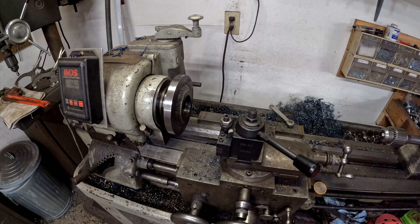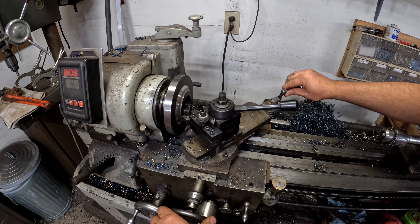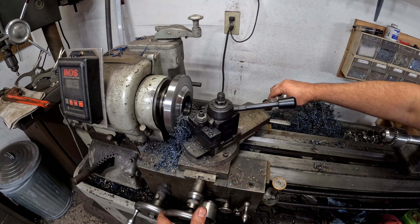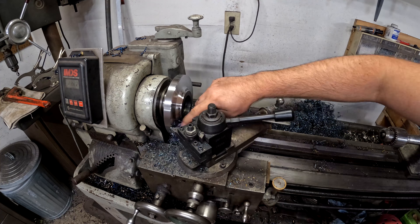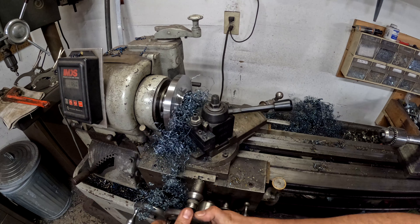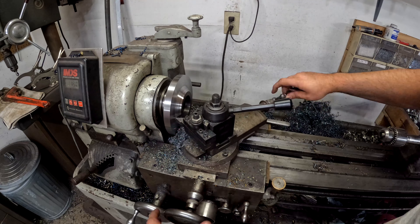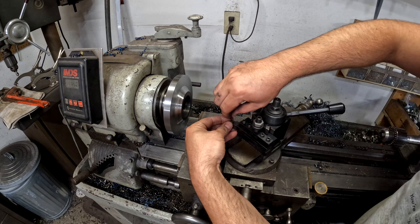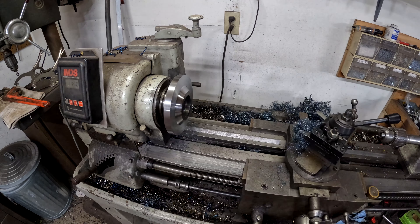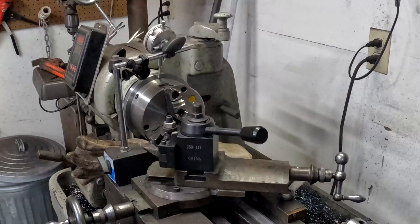It's flipped over and at this point I'm machining off the weld. At the end of the day this is going to look like one piece — you won't even know it was a hub welded onto plate. When I hit that stainless it is hard. It may have work-hardened or there might have been some interaction between the 4140 and the stainless during welding. Machining off that weld was seriously hard and 4140 is just stringy. I've got carbide inserts so I gave it all she had — cheap carbide inserts, destroyed a couple, no big deal.